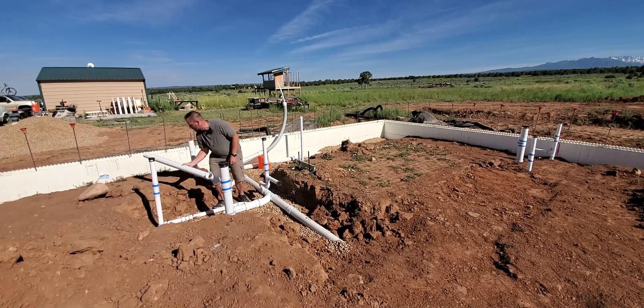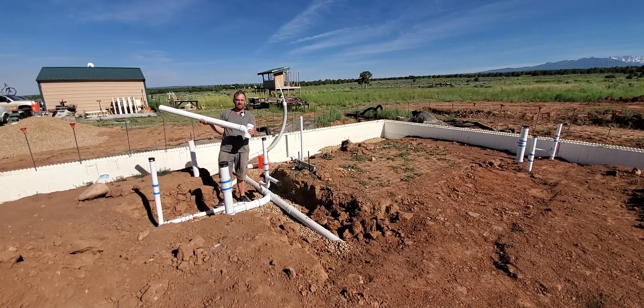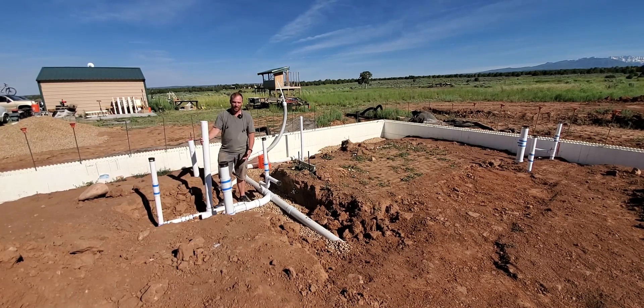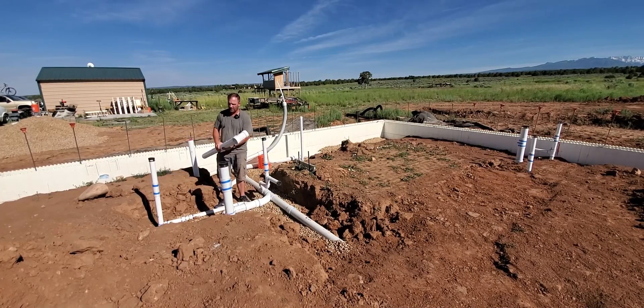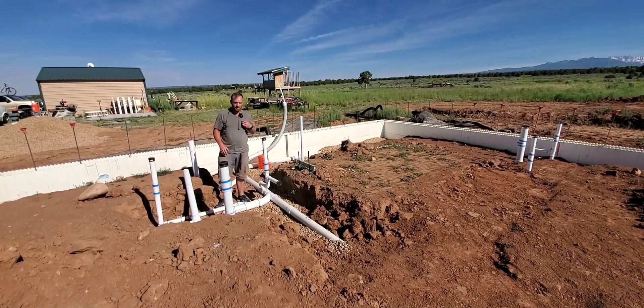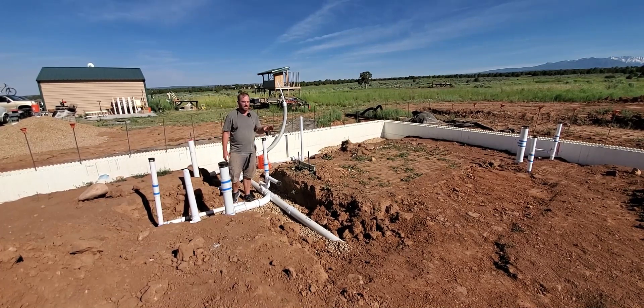Another thing — I was told to build this. It's just a three-inch sand tee with a three-inch pipe glued into it. These two vents are in a wall, and I was told to just put this in the wall — that is for radon. Apparently this is all we need for radon mitigation. I know there's more that could go into it. But other than that, everything passed and it can be covered. You can see our plumbing's all covered up and we're moving on to the next phase.